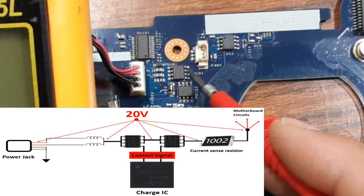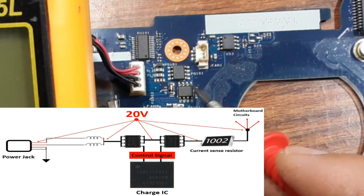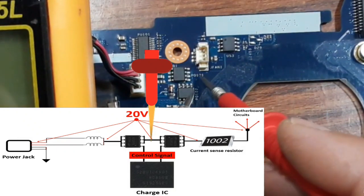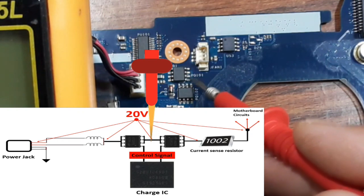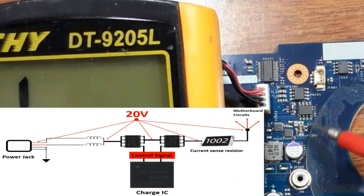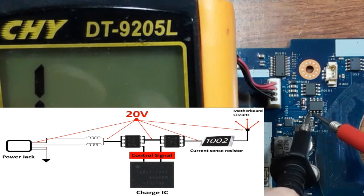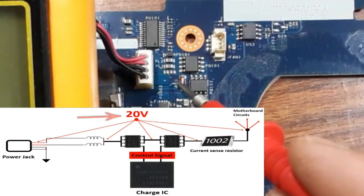The source of this MOSFET is connected — here we have the dot marking pin number one, two, three. The fourth pin is the gate, and here we have the drain. The source of this MOSFET should be connected to the source of the adjacent MOSFET because they share the same path. One probe here on the source and the second here — as you can see, the sources of both MOSFETs are connected together. The drain pins are also all connected together.